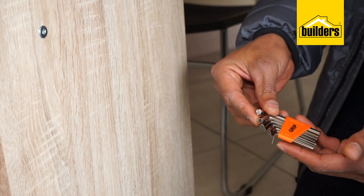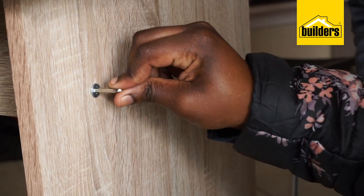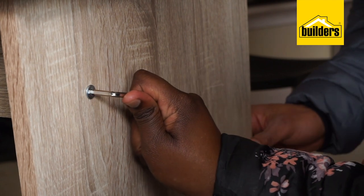Owen, I'm going to take advantage of having you over. I've been having issues with this table — it's a bit wobbly, and I know I need an Allen key to just strengthen it a little bit. Which one should I use to tighten this up? You're right, you do need an Allen key to sort out this desk. It's a pre-packed product and we're going to tighten up these hexagon nuts. This is a 4mm Allen key that you'll need. When putting this Allen key in place, make sure it goes into the bolt first and make sure it's the right size. If you try to put a smaller Allen key in there, all you're going to do is strip it, and you also stand a chance of stripping the nut.